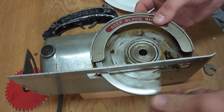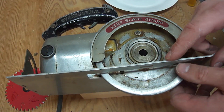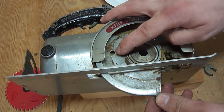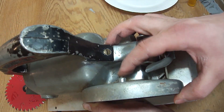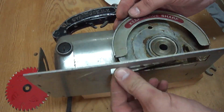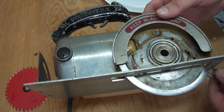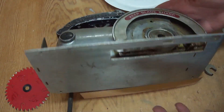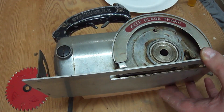Now I want to get this blade guard to work a little more smoothly — it's sticking just a little bit — but first I want to show you an interesting feature on this saw you would never find on a circular saw made nowadays. There's a hole right there and a spring-loaded pin here on the back of the upper guard. Because there's no little lever like a modern circular saw has to retract the guard for plunge cuts, this needed some other way to lock the guard out. You push the guard up until the hole lines up with that pin, push the pin, and it actually latches the guard up. You would never catch a manufacturer having a guard retraction lock like this nowadays.